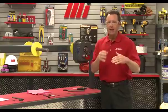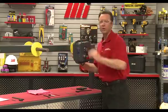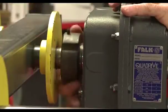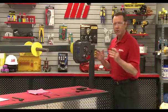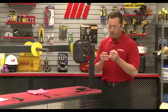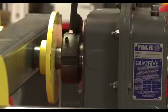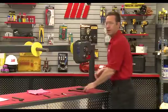Now loosen the nut back only until it can be turned by hand but does not unseat the taper. Then re-tighten the nut hand tight and mark a spot on the top of the driven shaft with a Sharpie. For the 5107 unit, mark the bushing nut 90 degrees from the first mark. Note that larger units may require a 180-degree offset — check your owner's manual for the proper setting. Then use the spanner wrench to tighten the nut until the two marks are aligned.